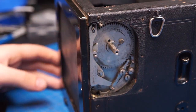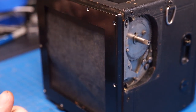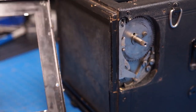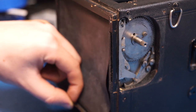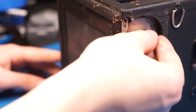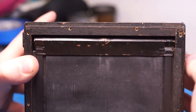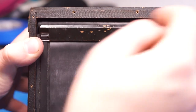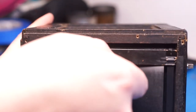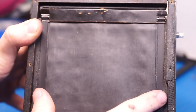Now let's see what's trying to happen here. I haven't taken this back off yet because that's actually part of what's going on — this metal rib is pushing against the back couple of different parts, and that's really integral for what's happening. If we slip this back off you'll see there's kind of nothing — it's just a stamped piece of metal, that's all it is. But the big part is we have this rib, this metal one, and when we wind our shutter up that's going to make it to the top of this travel. This rib is actually mechanical — it's part of what's allowing the spacing here, and these are two different materials that I've had to put in this shutter in order for the system to work.